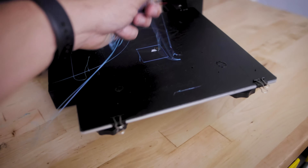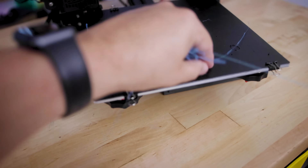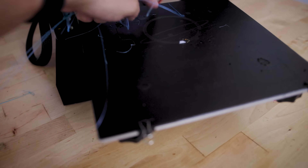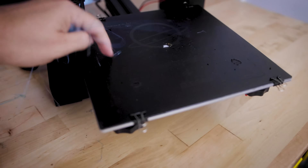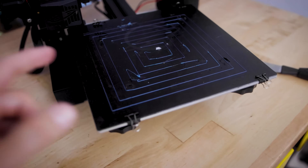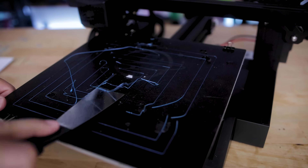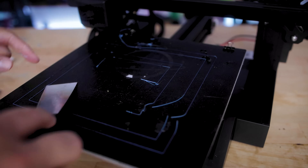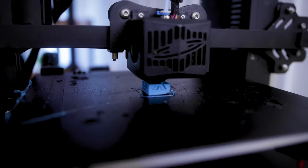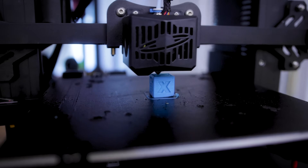In theory this should work and it's not coming up — when I peel up the filament, it's not coming up with it, which is good to see. It is digging into it quite a bit when I had the nozzle too low in certain areas, though. The second go at this went slightly better. One thing I'm thinking is going to be an issue is it's not perfectly uniform — all depending on how I laid down the paint, sections of it might be very slightly thicker than others, which might be accounting for some of the layer inconsistencies I'm seeing when trying to level the bed.